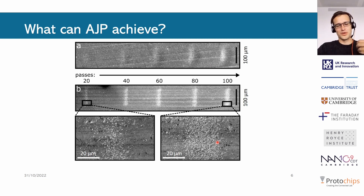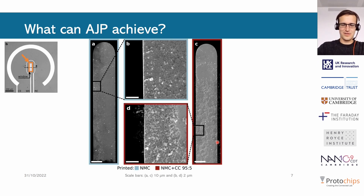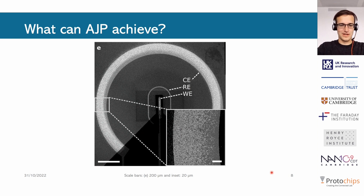This gives us the opportunity to produce tiny features that are just the right size for deposition on the operando electrochemical chips. If we try and print these materials on the actual chips and zoom in onto the working electrode on top of the silicon nitride window, we can print on top of it. Under an SEM we can confirm that the material indeed goes on the electrode, and we can control the coverage of these layers as well as the composition. In the blue and red traces, these are two different inks — one is pure NMC811, the other is NMC811 with a conductive carbon additive — so we can mix in different materials to form more complex structures, which can be quite useful for the electrochemistry.